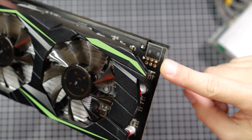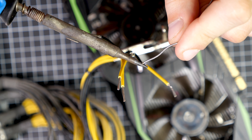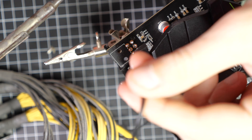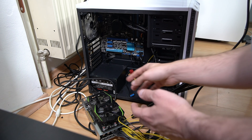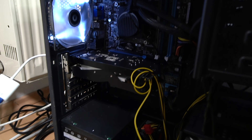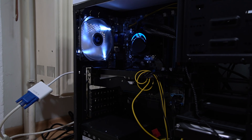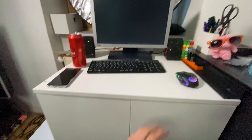After exchanging the BIOS chip, I saw that this card has no additional 6-pin connector for the extra power a GTS 450 usually needs. So why not give it a try and connect it to an external power supply? I'm not sure if that's working because it's also missing a few components, but I just soldered some cables directly to the pins of the GPU, and then it was time for a test run. It's time to revive the computer — I hope it won't burn down. We have the graphics card here with the modded BIOS and extra power to the 6-pin connector. I'm really scared, so let's give the GPU some power. Turn on the PC and... the fans are spinning! The GPU is on! Let's check if we can get a signal. Okay, it just hangs up and freezes. Let's try to reboot. And there we go!